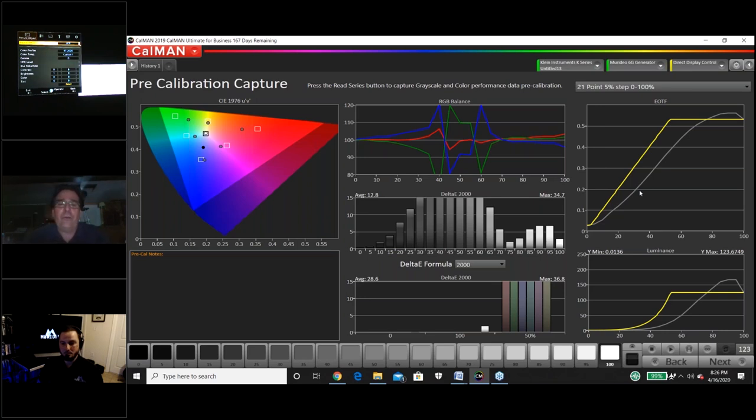So how do we make a similar look to a flat panel? Let's take for an example a reference panel out there, and I'm just going to ask you, Jason, what is a somewhat consumer reference panel that has tone mapping that you do a lot of? Probably similar to what's behind me, like an LG C8 or C9. Okay, C8, C9, and what's the light output of a C8, C9? A lot of them I've seen are in that 700 nit range. Okay, I'm gonna play with your number a little bit. I'm gonna say 600 nits, just because in my head 600 works better. Yeah, that's okay. Okay, so if I have a display that's being used for reference content in the home environment, and there's going to be some tone mapping going on, it's going to be 600 or 700 nits plus some tone mapping range.